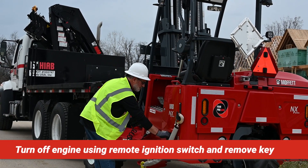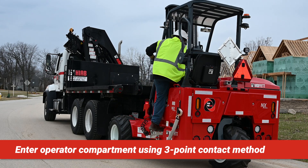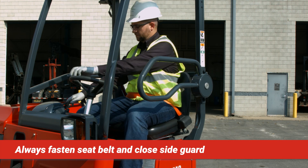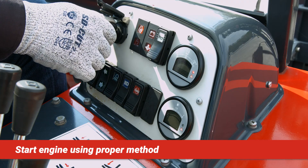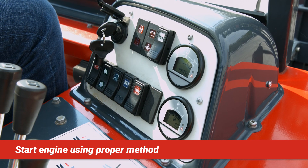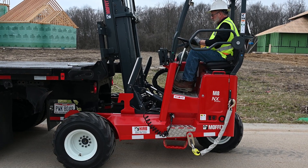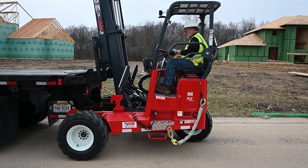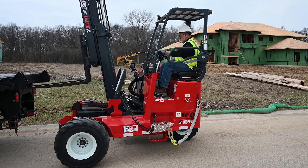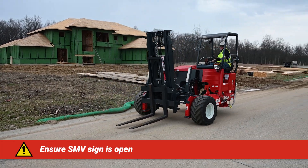Press the down arrow button and hold to lower the machine until all three tires are in contact with the ground. Release the button. Turn the key to the off position and remove it from the remote ignition switch. Enter the operator's compartment using the three-point contact method. Sit in the operator seat and fasten the seat belt. Rotate the side guard down. Insert the key into the ignition switch, turn to the on position for three seconds, then fully to the start position. Release the key when the engine starts. Pull back on lever one to raise the fork slightly and pressurize the mast lift cylinder — this will allow the forks to clear the fork brace. Ensure that the rear wheel is pointing straight ahead and slowly reverse the forks out of the fork guides looking in the direction of travel. Lower the forks as low as possible, keep the mast extended fully forward, and drive away always looking in the direction of travel.